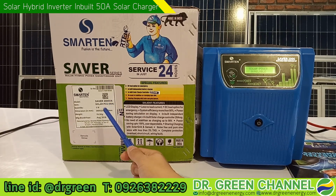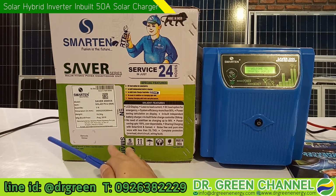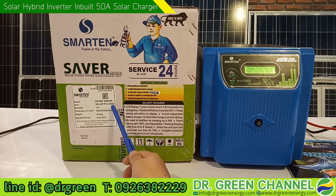From the information here, you will see the model is the Saver 2000 VA, and the charging current for the solar supports up to 50 ampere. So in this case, for example, if you use solar panels like 300 watt, 330 watts or 340 watts, you can connect up to 4 or 5 panels if possible. But the total current when you connect the panels in parallel should not exceed 50 ampere.